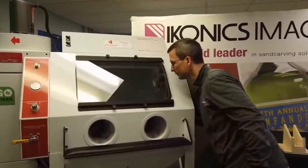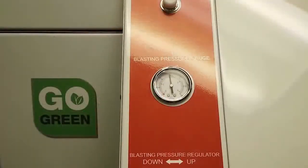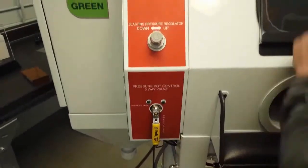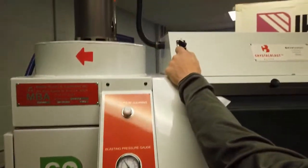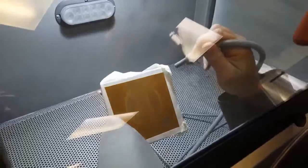When you sand carve into any stone, like this granite piece, you're going to get depth. So I'm blasting at 30 psi, which is enough depth on a halftone, because I can't go very deep because the dots are very small. The deepest line is wide, just like everything else we do. But with that depth, I'm giving it more warranty and a longer lasting image outdoors, because the erosion, everything affecting outside, is not going to lose your image as quickly.